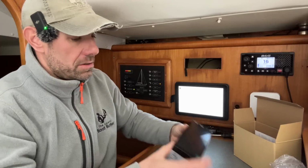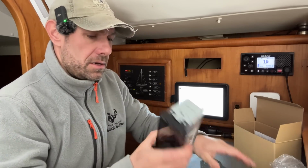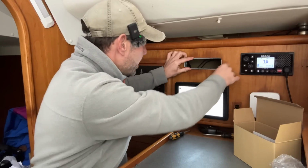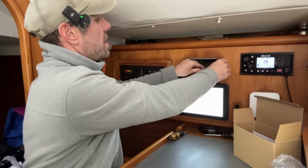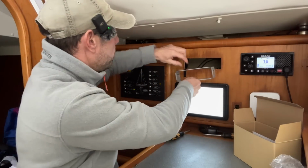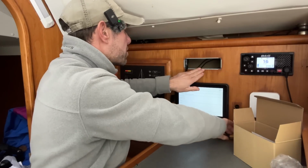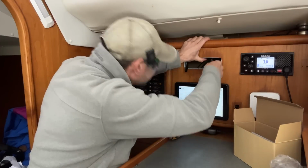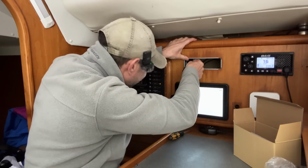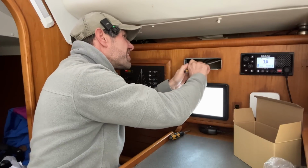The finest Chinese-made Apple CarPlay car/boat radio, and I'm pretty sure that all I have to do is slot this cage thing in here, having fitted a few radios. These things have little push-out tabs on them for different widths of material when you're installing them. So I'm going to chuck that in there, bend out the tabs probably with a screwdriver, and then this metal cage thing will stay in position. There we go, that's locked in position now, or largely locked in position.